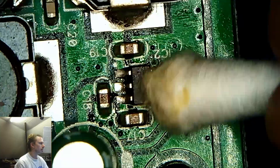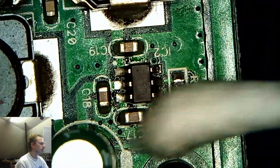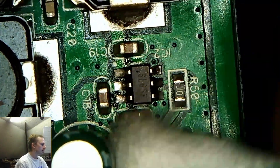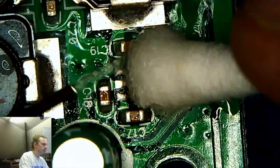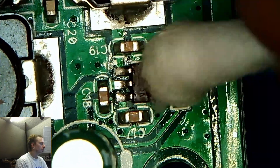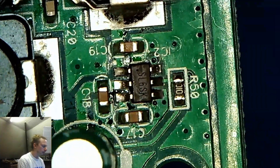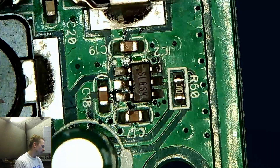There are just some bridges on here, so I'm going to come in with my soldering iron and just try to clear those up. That's the bridges cleared up. So I'm just going to take the new chip and place it down roughly in position. Then I'm going to come back in with the hot air from underneath, and hopefully as the solder melts that should just start to move into place. Whilst this is still hot, I'm going to come in with a cotton swab and start to remove all of this excess flux. That went quite smoothly. We'll double check those legs — I'm not sure about the top right one here, whether it's quite in place. I'll just get some IPA to clean this up. It maybe came with the IPA just a bit too quickly — there's still some heat in the board. But it looked like it went into place pretty well. As that's cleared up, that looks good. I'll just come in with my tweezers on the top leg and give it a little nudge — no, that's solid. Those three all look solid as well.